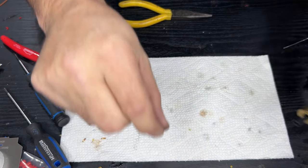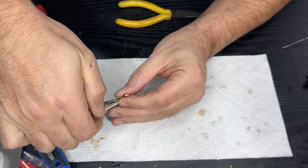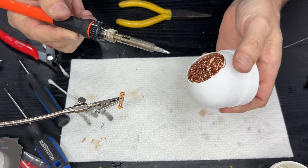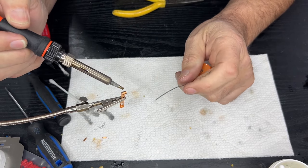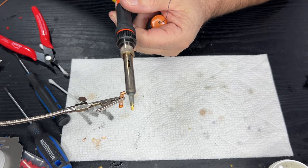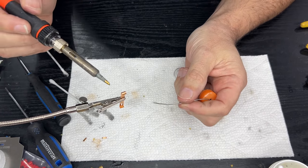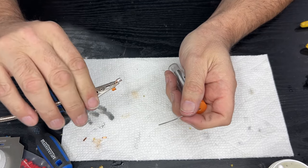Nearly lost the spring - careful of that. We'll get our little wire onto the strip, put a bit of flux in there and clean our soldering iron. I can't stress how important it is to always have your soldering iron nice and clean - it saves a world of trouble. Put a bit of flux in there - this needs to be warmer. Basically the bigger the bit of metal you're soldering to, the hotter it needs to be - just ask anyone who's ever tried to weld aluminum.